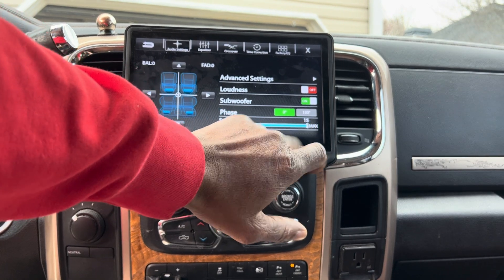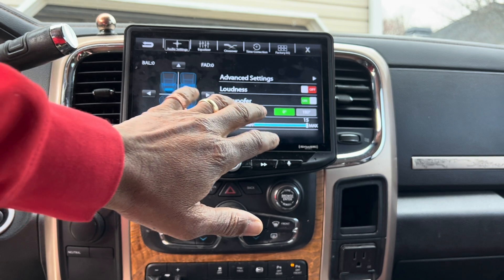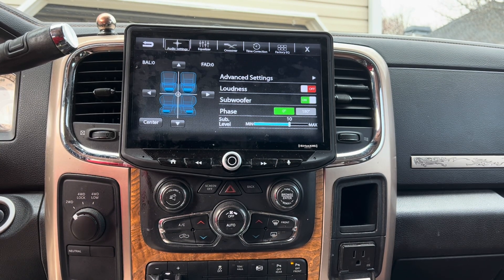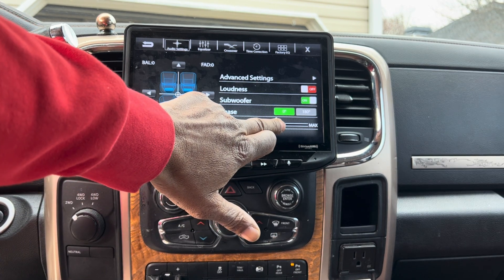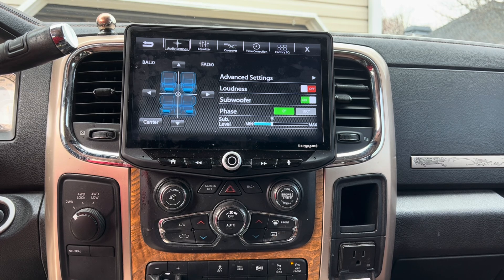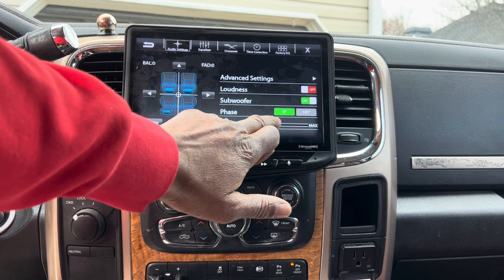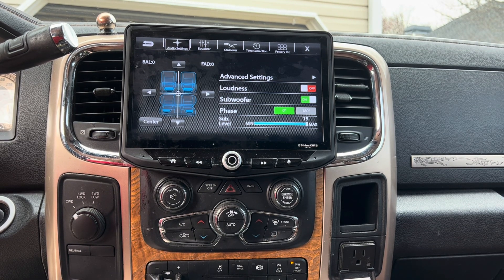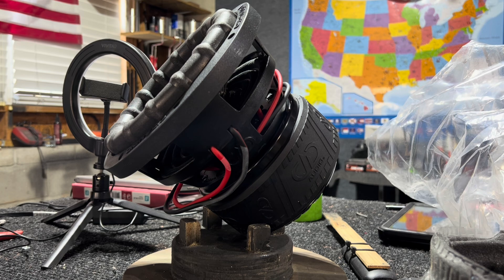At level 15, that's the full signal — I'll get 3,600 watts. If I dial it back to 10, I'm at 40 volts, at 1,600 watts. And if I scale it down again to 5, I'm roughly at 500 watts. All these are before rise. So whenever I tell you I'm sending it to full power, what I've set the AC volts at is 60.